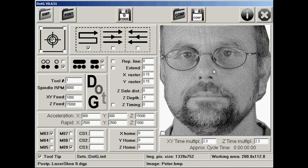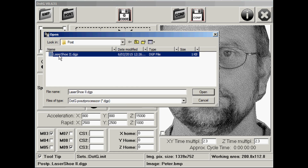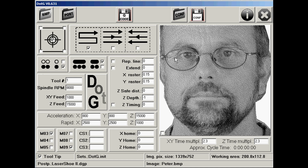The BMP option allows us to open and import a bitmap file — it must be a one-bit file as I created in GIMP. Post is the post processor, and here I have created a laser shoe post processor, so I'll select that and open it so it will output correct g-code for my laser setup. The g-code button is used for saving the g-code when finished. Down here I can decide where I want my origin point to be — I've chosen the center of the stock. Here is the machining strategy — I'll use the back-and-forth one.